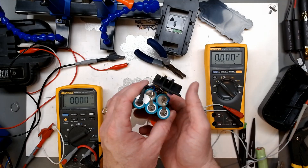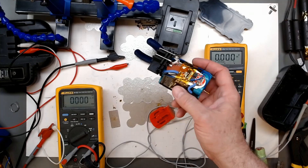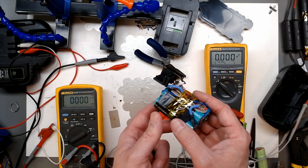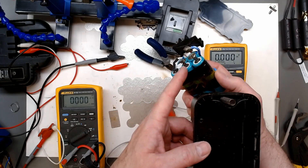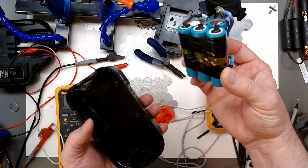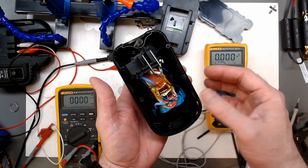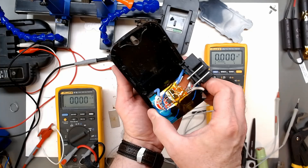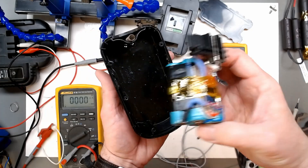With that said, it's not like it wouldn't work in a pinch if that's all you had and you had the proper BMS on it. We are fairly balanced - nothing went over, nothing's lagging behind. Overall this is a pretty successful replacement for the NiCad battery, getting your old NiCad tools back running again, with still a lot more capacity than the old NiCads. This is just a small 2.0 amp-hour 20-volt pack - very low capacity by today's standards. The best thing would be to use 3500, 4500, or 5000 milliamp-hour cells and still do 5S 1P.